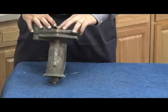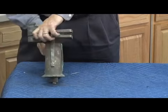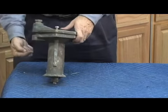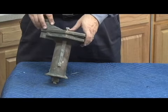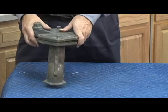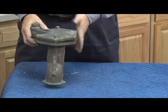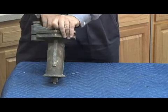So here's the 2.5 and 3 inch 909 relief body out of the checks. You can see it mounts between the checks right like this. Relief valve sensing line comes through here from the body. Up here where that test cock is, the air bleed that people confuse as a test cock. You do not have to remove the body for the average repair. You would leave this between the checks for the average repair, but I'm going to have it loose like this just to show you what it looks like.